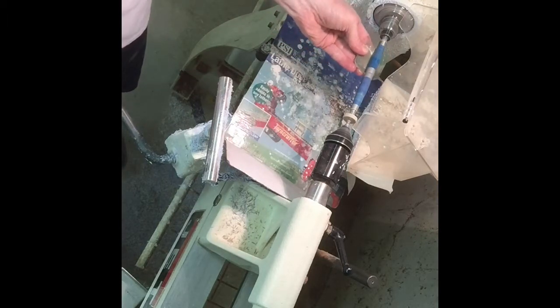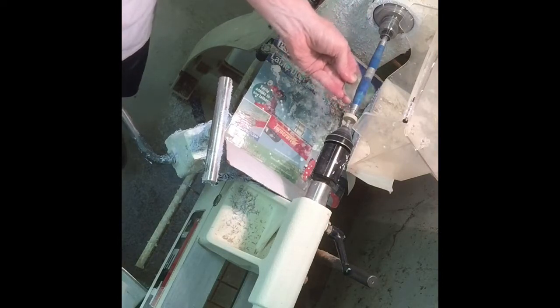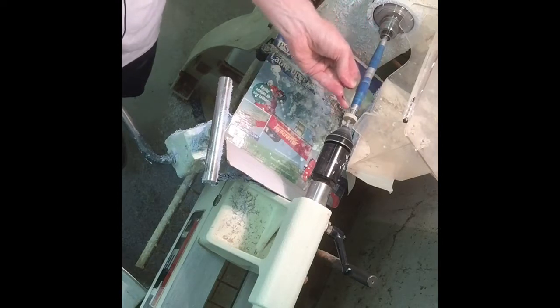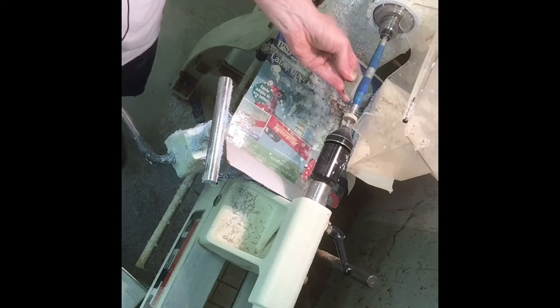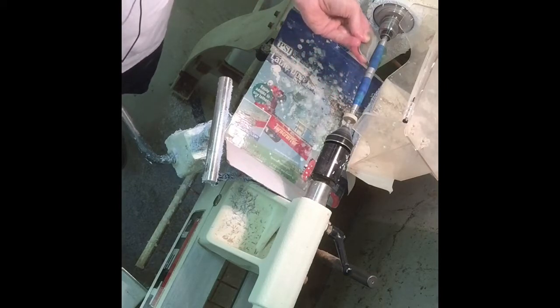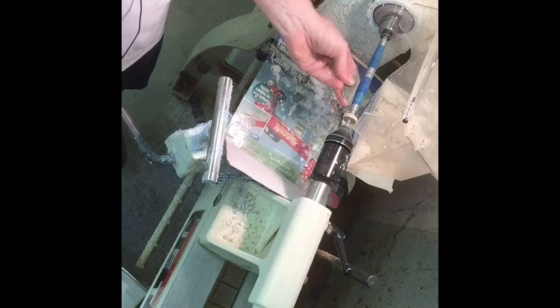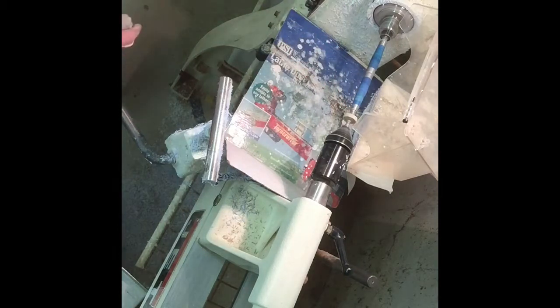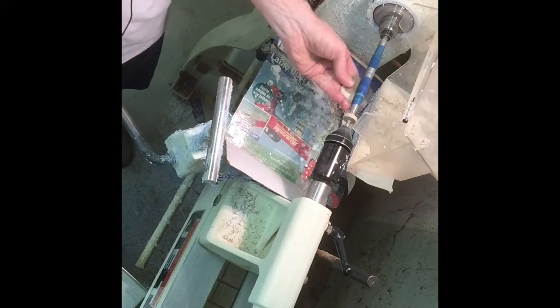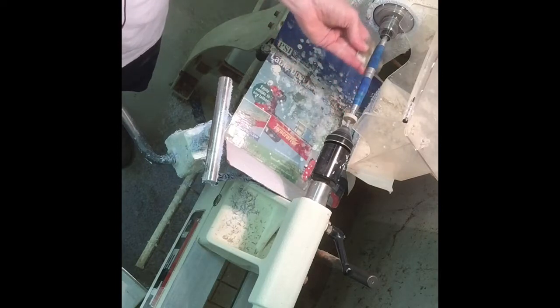As you'll see, this will turn out quite nicely polished toward the end and as shiny as you'd want it. I do use a high gloss, but you can use a satin liquid polish at the very end if you don't like it as shiny. I like my pens shiny and my furniture satin. On pens, even wood ones, the high gloss is good. When you do a super glue finish on wood and get down to this stage, it's very similar to the acrylic — but that's a different video.